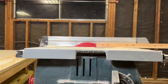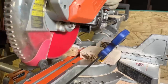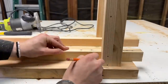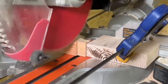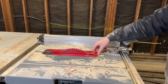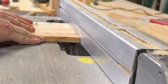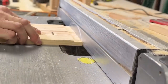I started off the next day by milling up a couple of 2x4s into some cross supports that'll attach to the legs. I also milled up a bunch of slats which will become a shelf on the bottom. Then in my miter saw, I created another set of tenons in one end of the support pieces. Making sure it's aligned on the left side, I mark the final length of my bottom support pieces, cut these to length, and chisel out the last tenons in my chop saw. Then I swap out the blade in my table saw for a dado stack to cut the tenons out of the remaining pieces — this is the more efficient way, but I didn't want to keep swapping blades earlier.